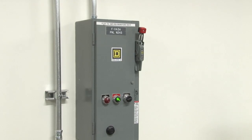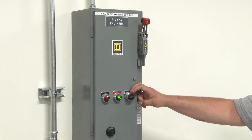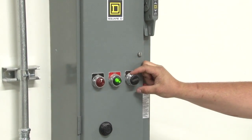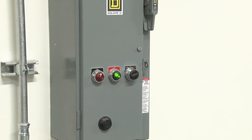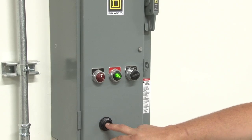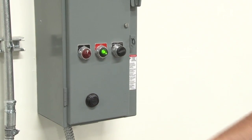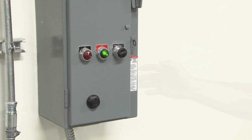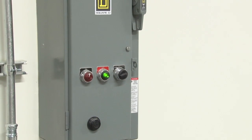Located over here is the starter for that fan. Siemens operates it in the auto position. If for some reason it doesn't have a command or you want to override it, you switch it to the hand position. If the fan was to trip out, say it overamped or there was an issue, inside the starter is the reset. It's a set of contacts. With the overloads, you reset the overloads and the fan will come back up. You can check your voltage here, your amps, or you can also check up there.